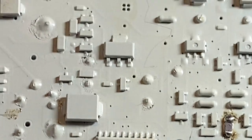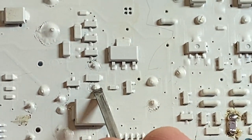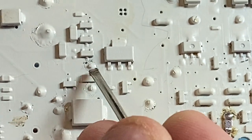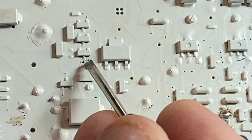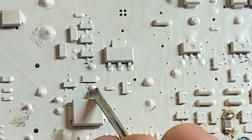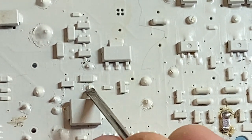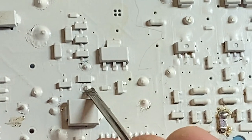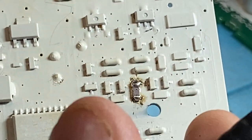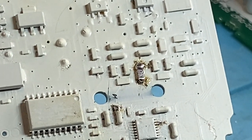Make sure that you discharge that pin to that pin. Just hit it with a pair of side cutters on top so you can actually get to the metal of the pins through the white paint. Just snip a little bit. I just bang it with my side cutters, and you'll see sparks. You've got to discharge this capacitor before you touch anything around here, because it will have a flow-on effect and blow things up.